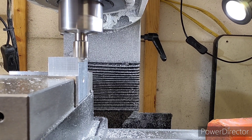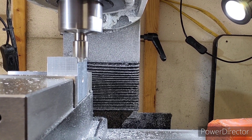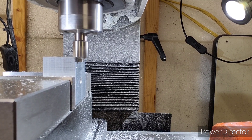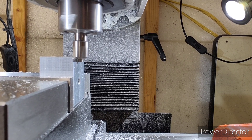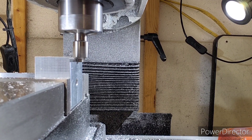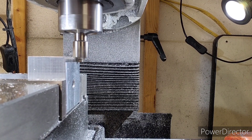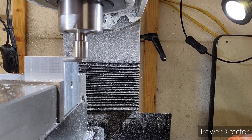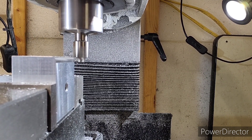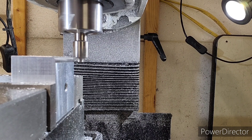That's just one way of doing this. A little tiny bit of debris coming off, not very much at all — it just gives us a better looking finish. All right, I'm happy. Let's shut this down and take a look at it real quick. Let me grab my radius gauge. We'll do that on the bench. Simple, fast — eighth inch corner rounding end mill.